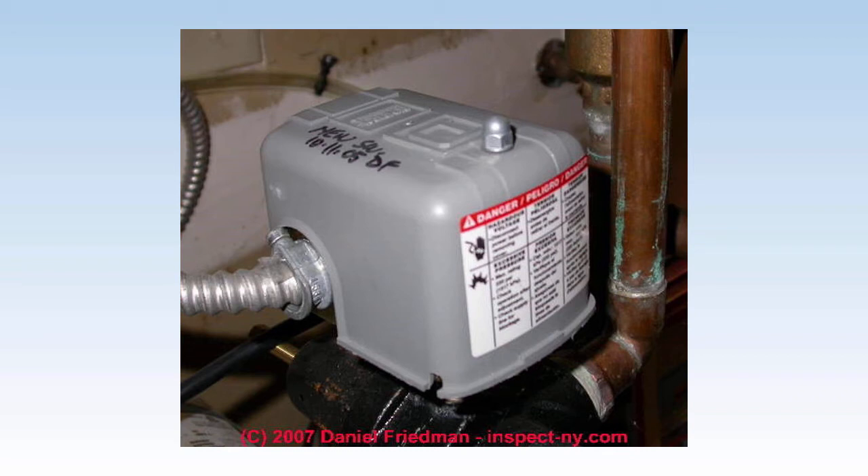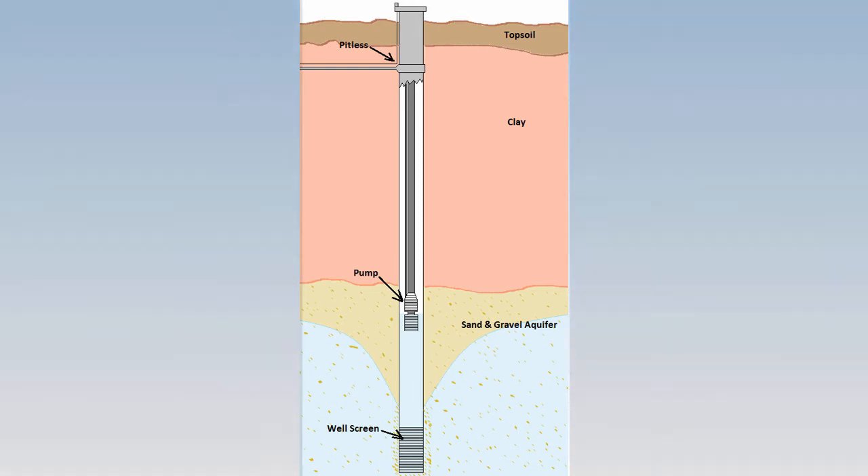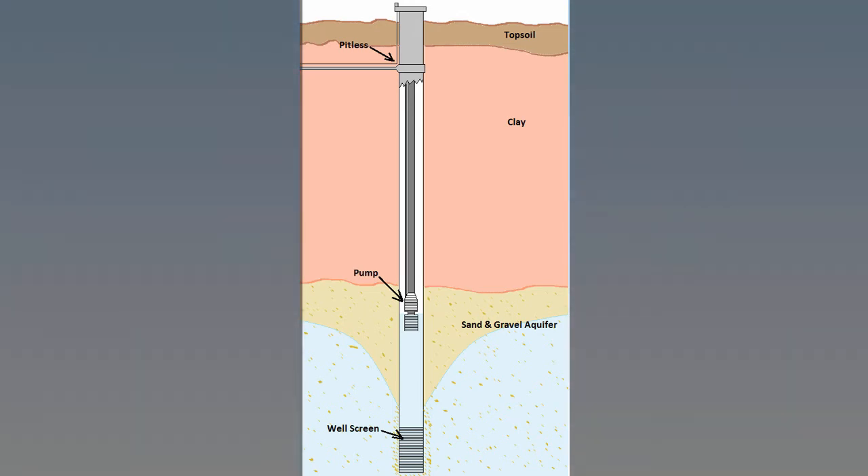Another way to protect your pump is to install a low pressure cutoff switch. Your pump is connected to a switch that monitors the pressure in your water system. When water is being used, it is initially coming from the pressure tank, and as the tank drains, the pressure drops. When it drops to a certain preset level, the pump kicks on to assist in providing water to the system. If you have a low yield well, or are using more water than the well can yield, eventually the water level in the well will drop to the level of the pump intake, causing it to start pumping air. A submersible pump is cooled by the water in the well, so if the water level drops below the pump, the motor can become damaged or overheat.